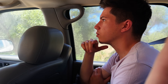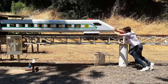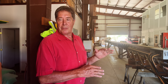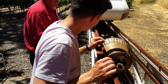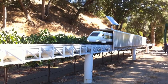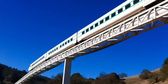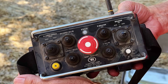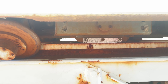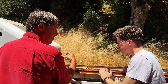John, who worked for Flight Rail, was very kind to show us all over the facility, which is also a vineyard, and let me have an up-close look at their 1/6 scale model train built to demonstrate what vacuum-powered trains can do. We're using air pressure or a partial vacuum to either pull or push a piston through a sealed tube, and the passenger modules are coupled to that piston magnetically. The trains operate using a remote control that actuates stationary air pumps along the track, and it can also apply the train's brakes, although the trains can be atmospherically braked as well, which is a pretty cool side effect of controlling your train with air.